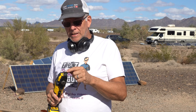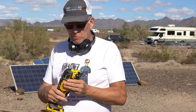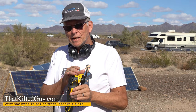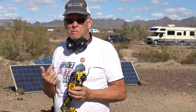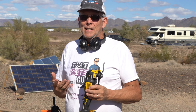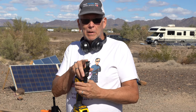Possibly if you go slower it helps, but I tried to go at a normal pace. You could hear I wasn't laboring the motor, so I tried not to push it too fast and overheat it. It's possible I still did something wrong. What I can tell you is the T-Rex is the one that impressed me the most, and it's the one that says up to 50 times longer. The bi-metal is typical bi-metal — DeWalt quality, so it's good — but as soon as I tried to cut the rebar it tore up and was pretty much shot. I'd say these carbide blades are definitely tougher, and the T-Rex is the one I would buy.